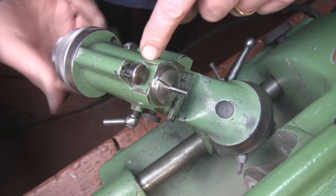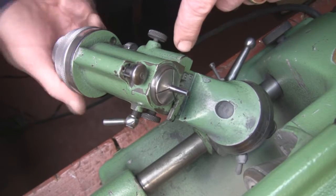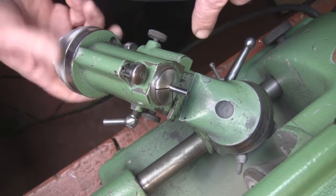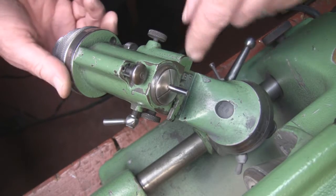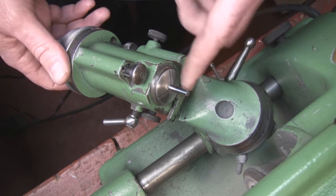There are no bearings in here, and for those of you thinking this would be a great way to use it as a whirly jig once in a while — it's okay. They do sell a little handle that fits on here so you can crank it, but there are no bearings in there so it's a friction slide. That's fine for grinding cutters but not so great for circle grinding things. So for our purposes now we've got a carbide blank mounted and we want to split this thing in half.